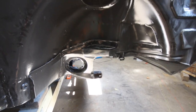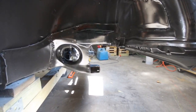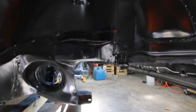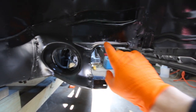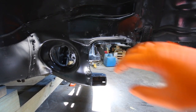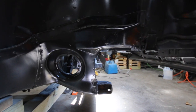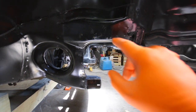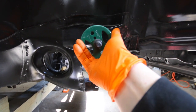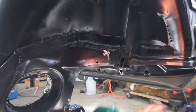I have a hole saw that I'm going to use. I've basically marked out where I want the hole saw to be — I measured kind of flush with this, made my center point, and then measured up so far where the hole saw will go. I've done it on the other side also. So I'm center-punching this, then I'm going to drill a pilot hole so it goes all the way through, and then come back with the hole saw and hole saw it out.